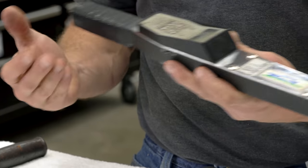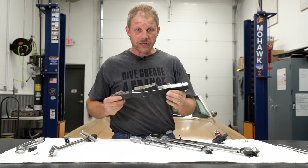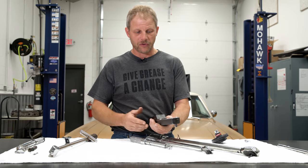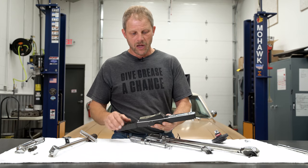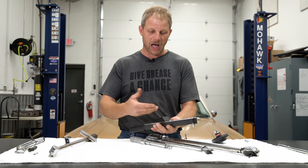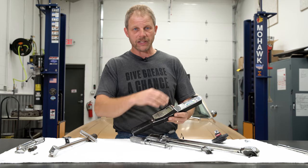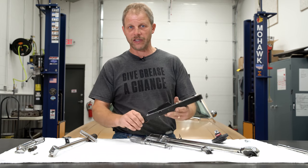Lastly, we have a digital torque wrench. It uses circuitry and a strain gauge to determine what torque is — the same function but far more reliable since it's not mechanical. It utilizes a battery. Some models actually record data, so on a production line you can track how accurate your operator was. This particular one does inch-pounds, Newton meters, and foot-pounds, so it has more range of units. You can set a min and max, giving it more versatility. It also allows you to read on the fly — as you're putting torque into something you can see where you're at. I use this a lot when setting bearing preload, where I need live feedback on rotational torque. For instance, when we put the pinion nut on our gear swap, I could read 15 to 20 inch-pounds of torque.